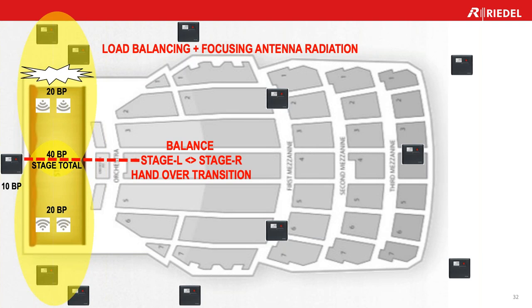What do you do to adjust that? A lot of times, right now the power level adjustability is antenna array wide and not able to be adjusted per singular antenna yet. You play with that by changing the azimuth and the elevation of the antenna. So let's say don't point the antenna directly at the stage, maybe offset it by 30 degrees. Play with the gain of the antenna by physically changing its orientation and where it's located.